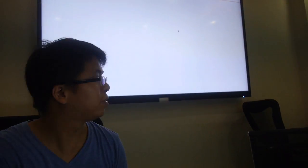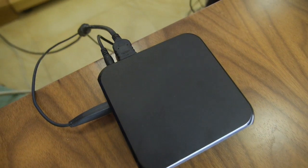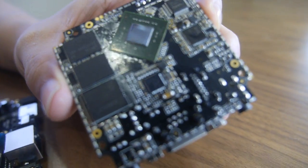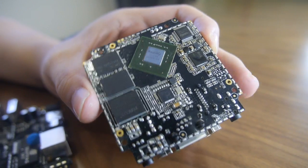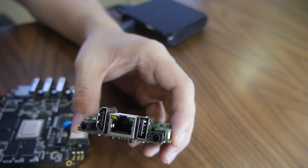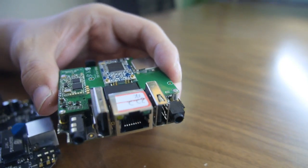We have workload tests — 3DMark running, and it's connected right here on their design. They also have different sizes, including a small one. This is also a 3288 board and it's claimed to be the smallest RK3288 board worldwide. It still has a rich set of connectors: HDMI, GMAC, USB port. The USB can output 2A power so it can connect a USB hub and support three to four USB hub ports. This board also features dual-band Wi-Fi, Bluetooth, and a G-sensor.